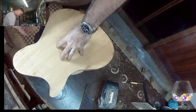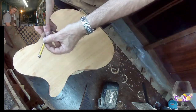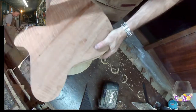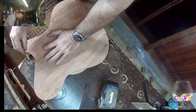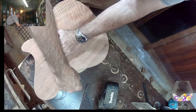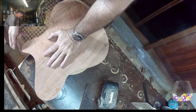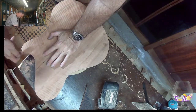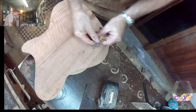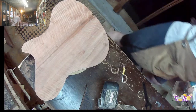Great, we're going to clamp this guy down and we're going to work our way around the edges with this bottom bearing bit here. Sorry, this way. And that bottom bearing bit is going to run along the sides, which are sanded nicely. So we are going to get a nice straight parallel inline edge to match the body with this cutter here. So let's do that. Let's get that guy sorted out, as they say.